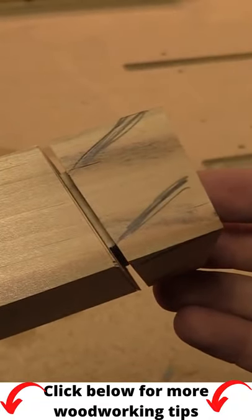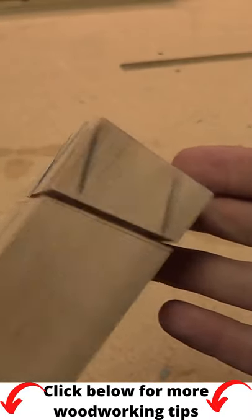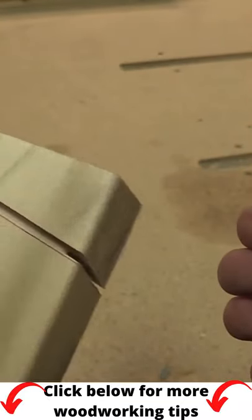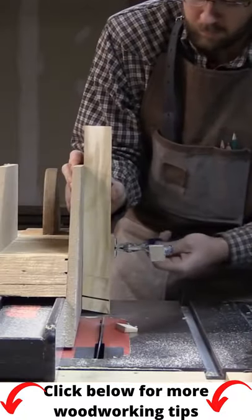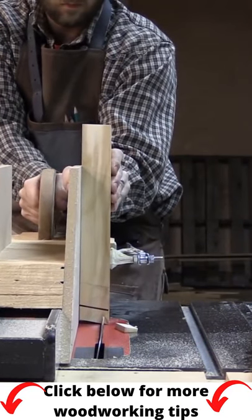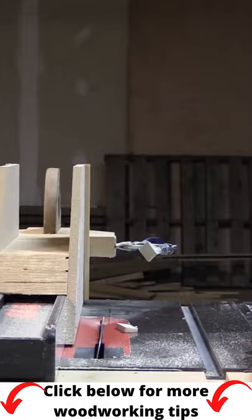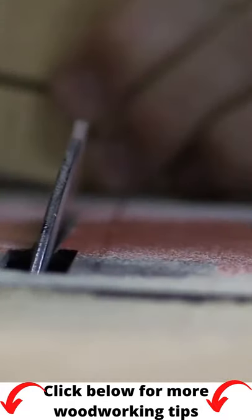So I drew some helpers for myself to figure out which way this crazy doubly angled tenon is going. As I look at it right now, it seems strange, but I think it's right. Here I'm cutting the tenons into the top of the legs. Since these are compound angled tenons, the cut needs to be made with two angles. So the blade is angled at 5 degrees, and the leg itself is angled toward me, or toward the camera, depending on what the cut calls for.